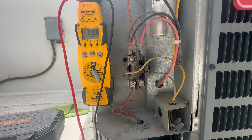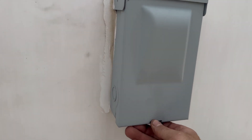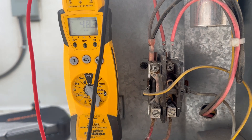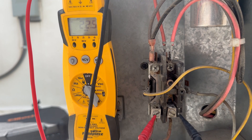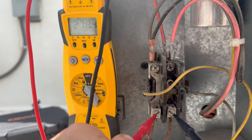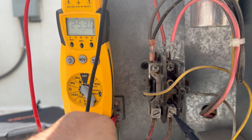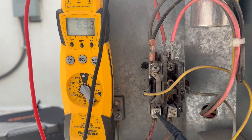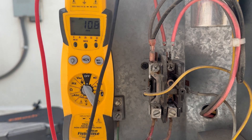So that's how you quickly diagnose the contactor under load. I'm going to remove the breaker. Another way we can check this contactor — whether it's good or not — with the power off. Let's just make sure we have the power off. We've got zero volts. That's just ghost voltage; this meter beeps with high voltage.